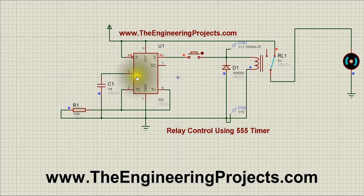If we go to the 555 timer, we can see there is a capacitor from pin 5 to ground, and a 100k resistor from pin 6 and pin 2 to ground, which is kind of a pull-down resistor. Pin 4 is pull-up — sorry, connected to plus 5 volts. The button is at pin number 3, which is acting as the output pin of the 555 timer going to the relay. There is also a freewheeling diode, which is just to avoid back EMF.